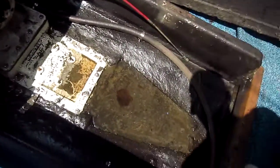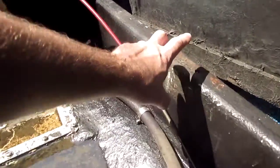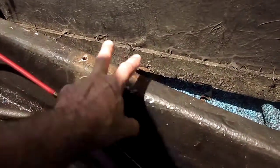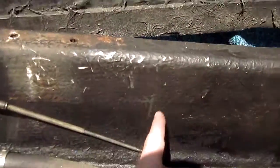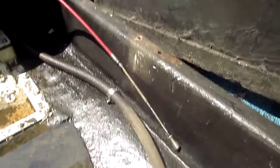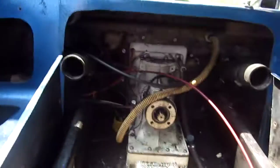For anybody worried about how to measure for the half stringers — I've been thinking about this myself. What I'm going to do is leave part of the stringer where the engine mount is, on both sides. I'll cut out most of the stringer but leave a couple of sections as a kind of jig — maybe a section right here and a section right here — so I can fit the new stringer wood in and have it land exactly where I want it.